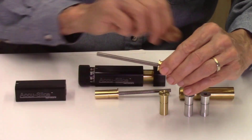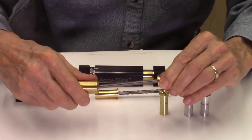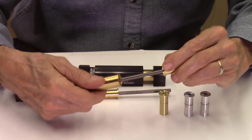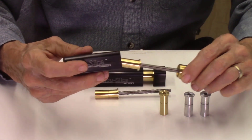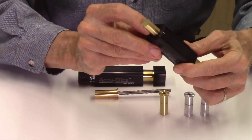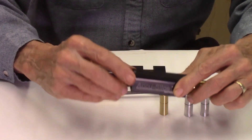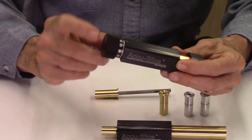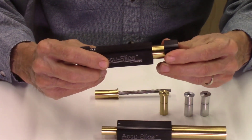What happens is this is then attached to another cylinder — another bushing which has that same 20 thread per inch left-hand thread. And that gets screwed into this system. Then this entire assembly gets installed into my housing, and once it's installed in the housing, a snap ring would go on to snap into that groove on that brass bearing. Then knobs are put on both sides at the end.